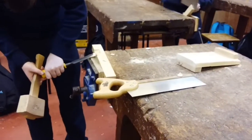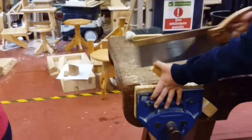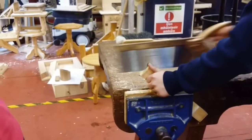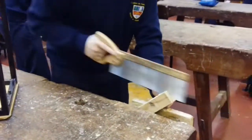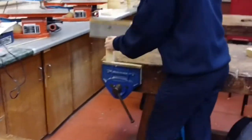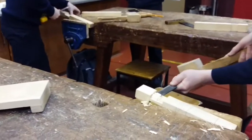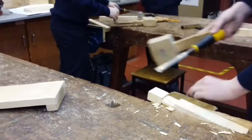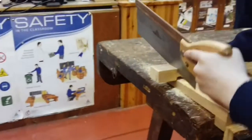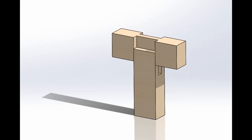Here we have some more trenching as well. Good grip of the chisel, though maybe a little bit too much being taken off at one go. A piece here has been sawn along the grain — slight adjustment on the left hand, good stroke on the saw, following it down to the shoulder line. More sawing along the grain: good positioning right up to the bench when you're right-handed. The chisel hand grip could be adjusted; he's finishing it off level. He should leave the mallet and chisel down when making any adjustments. The key thing to watch throughout the video is that all the key skills are being carried out correctly.